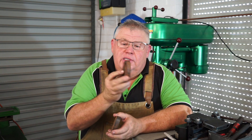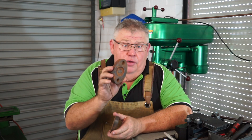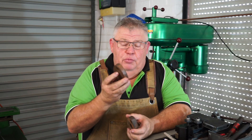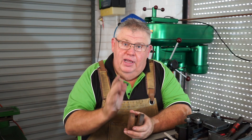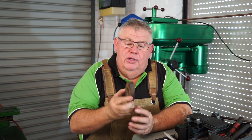These ones here were quite simple to do. This is the old one — roughly 1905, so over 100 years old. These have been recast, so I had to machine off the knobs, make them flat, get them to the right thickness. There were two of these ones to be done, so I had to machine those as well.